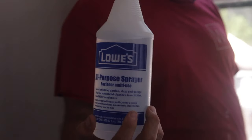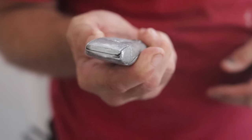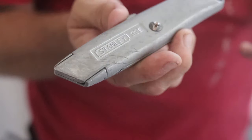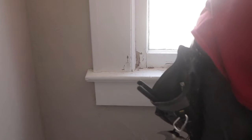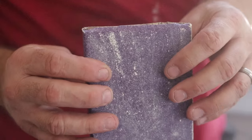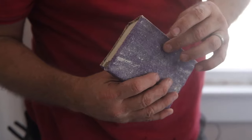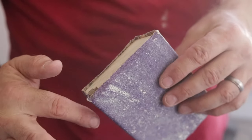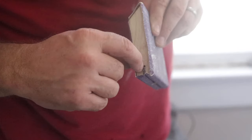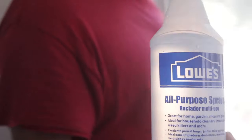Starting off with just a spray bottle full of water. You need a typical utility knife to cut the paint. The other thing I almost always have is some kind of sanding block like this - just something I made. You can see it's got a saw kerf in there and it's a block of wood with a triangle on it. The dimensions of this block including the saw kerf equal a half sheet of sandpaper, so I can just wrap it all the way around.